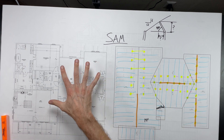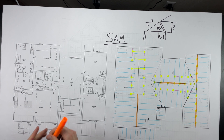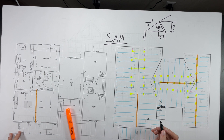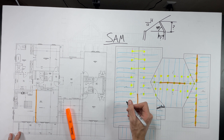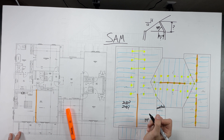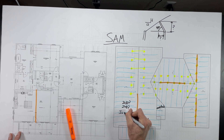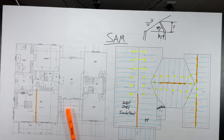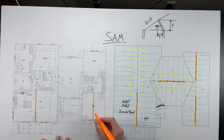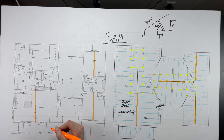Now it's time to copy all of these beams over to our ceiling plan so we can work on it. I want to pause here because the selection of rafter size over a vaulted ceiling is somewhat structural but also related to how you want to do insulation, or if you're going to do recessed cans — recessed cans have a certain depth, and you can only fit certain things inside certain rafter depths. So it's the builder's job to size those appropriately for the whole project, not just for structural requirements.